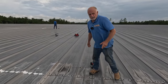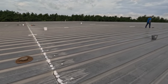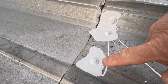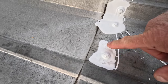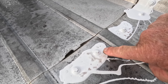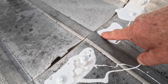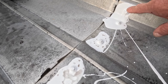To make double sure that everything is sealed, we started yesterday using super silicon seal. You can see how it looks — beautiful. The water keeps away from the screw, but it also seals around it. This will protect the washer, and if the washer was broken and you didn't see it, it will seal around the washer and the screw.